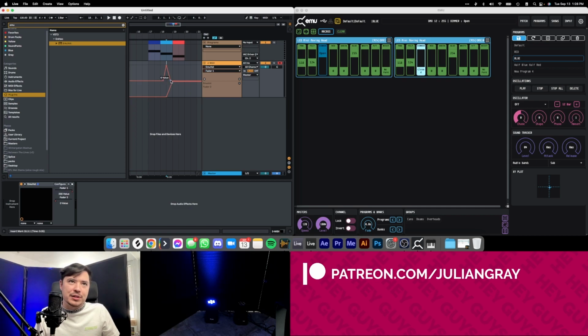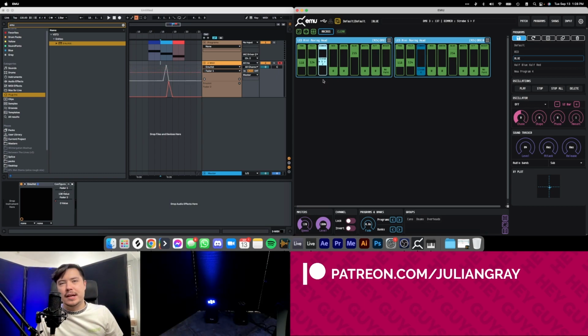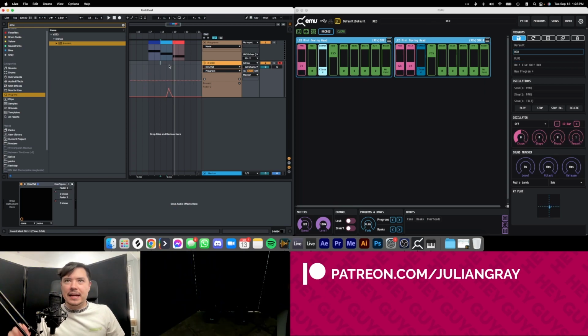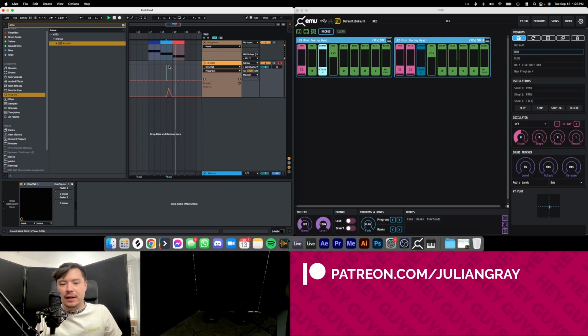Maybe they go sequentially. Now, one thing to mention is that DMX lights sometimes will have more than one feature attached to a dial. For example, this one has a strobe effect after maximum dimness. So you're going to want to find the maximum height of that dimmer effect and then apply it to that. So like 135 or something. As you can see, sequentially goes across. You can do this for as many lights as you want, up to I think 512.